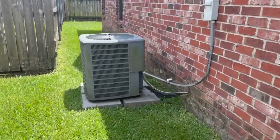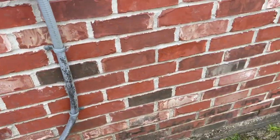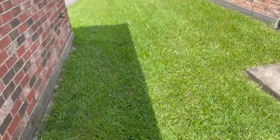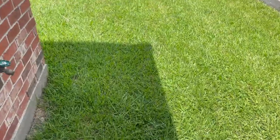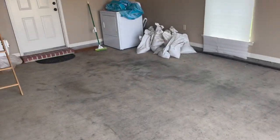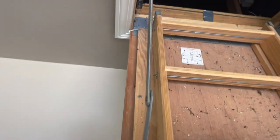Okay, so this is off. She's got the thermostat on off, but the fan inside is still running. But it's almost 100 degrees in the house. I'm thinking that she's got a locked-on heat strip in the air handler. Because even with the stat off, she is still getting fan and she's getting hot air. Not just room temperature air. I'm talking about hot air.